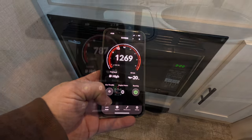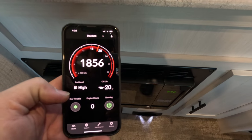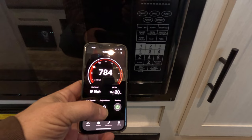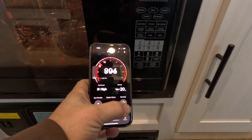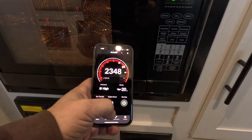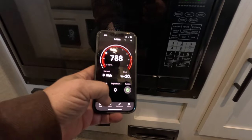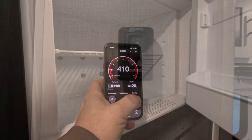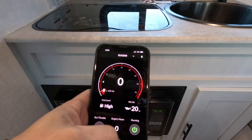I think we should turn the eco throttle off — there was a brief bog-down there. With the eco throttle off, the vacuum cleaner runs much better. With the air conditioner running, let's try the microwave at the same time — that's 2350 watts. It looks like this generator can power almost everything simultaneously. It would not be able to power the microwave and the vacuum at the same time, but everything else I can turn on and this generator handles it. With the air conditioner off, the only major thing on is the fridge drawing 400 watts. Turning that off brings us back down to zero.